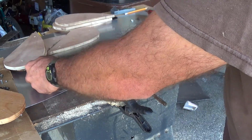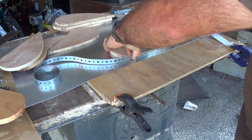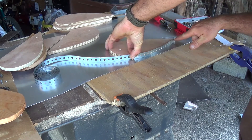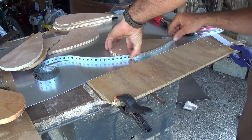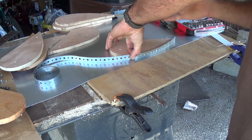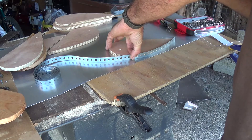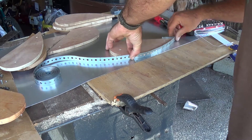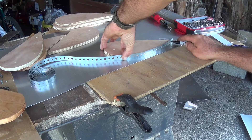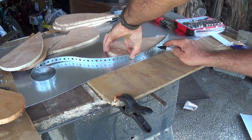I can use that as my template for all my pieces to see where things are going to be. Because the strapping is wider than the piece of wood, when I mark these holes it won't be centered on the wood, but it will be in the right place. So once I mark the holes, I can go back and measure the piece of wood and put a mark for the center on that line — that's where I'll be drilling. Here we go marking the holes, and once it's all marked I just go through and drill it all out.